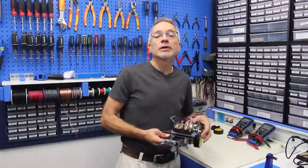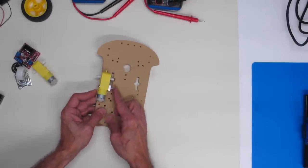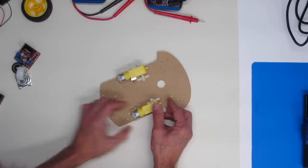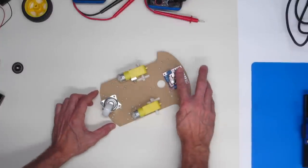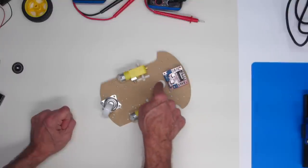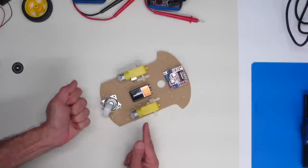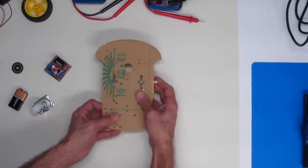Now let's see what we can do with the robot base we have right now. I've mounted one motor to illustrate where it goes and left the brown paper on the base so I can mark where I'll drill additional mounting holes. I'm going to place the motor driver on the bottom, with clearance for the heat sink from the wheels. Wires from the motor driver can go through a hole to the Arduino. I'll also mount a small 9-volt battery on the bottom to power the Arduino.